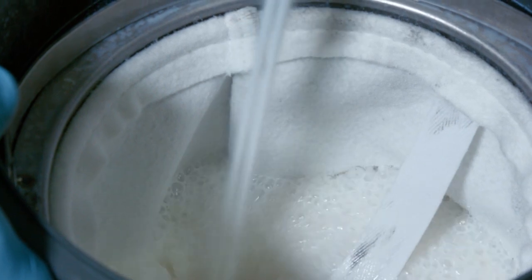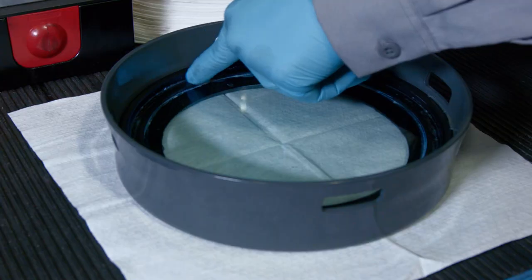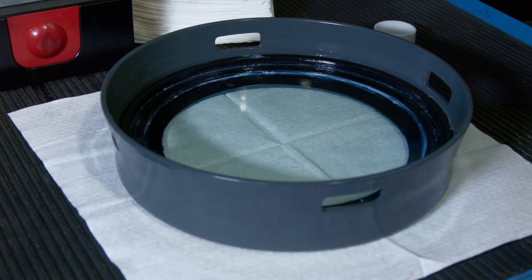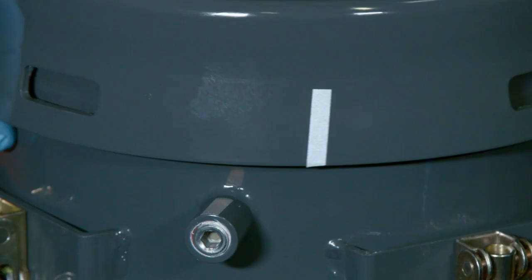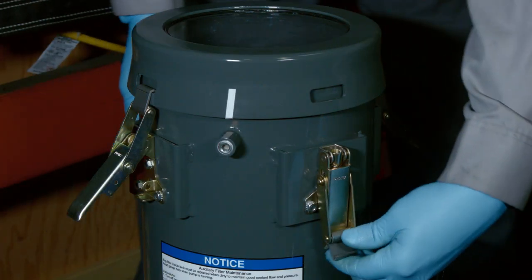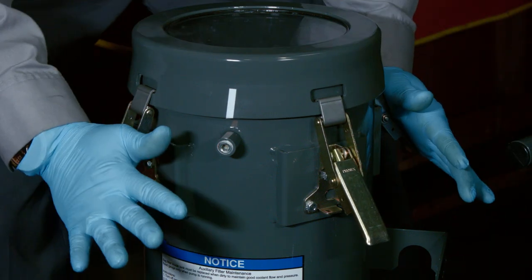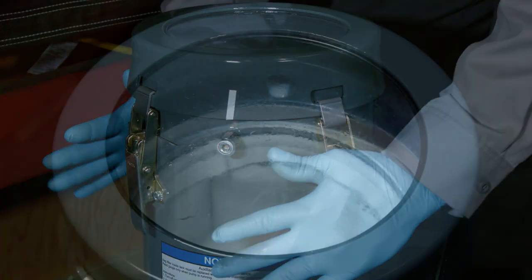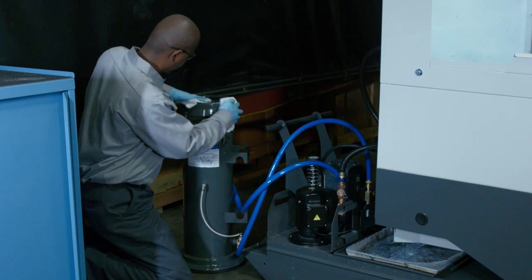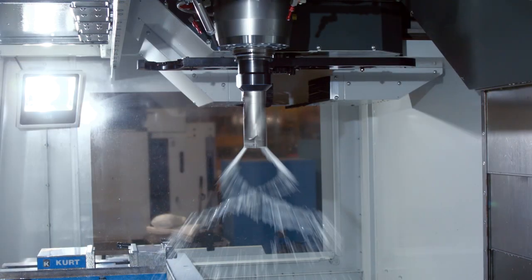Don't activate TSC until the tank is filled and the lid is latched in place. Before reinstalling the lid, Orville applies a thin layer of general-purpose grease to the seal on the lid. Then he installs the lid on the tank, making sure to match the alignment marks on the tank and the lid. He attaches the four latches — clamping each set of opposite latches at the same time will keep the lid from cocking. With the tank full, Orville activates the TSC system and checks that the tank lid and other connection points are leak-free.